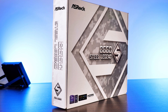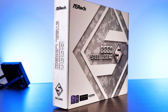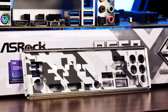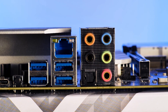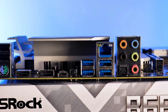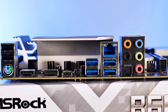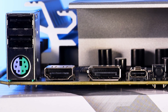With the 30-second Z690 vs. B660 recap out of the way, let's finally get a closer look at ASRock's B660 Steel Legend. Let's start with the I/O. Using the usual camouflage-style shield that Steel Legend boards usually come with, the B660 version greets us with a 7.1 audio jack setup including an optical port. Further up, we are looking at a total of 6 USB Type-A ports — 4 USB 3.2 Gen 1 and 2 USB 2.0s at the very top. Additionally, we also got a USB-C 3.2 Gen 2 port in the back. In case you are planning to use the iGPU that comes on those new Intel chips, ASRock provides a DisplayPort and an HDMI port.